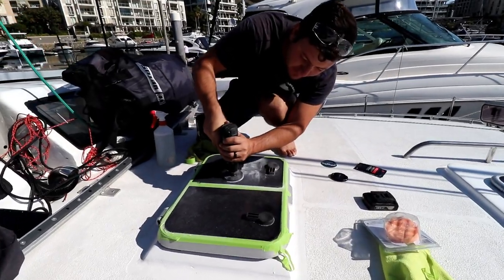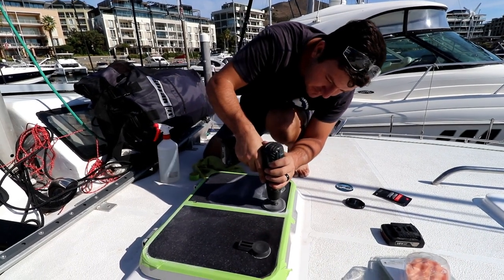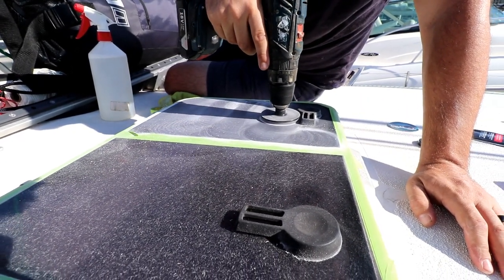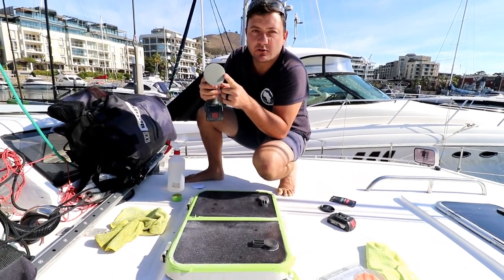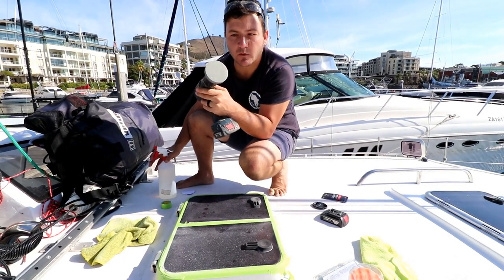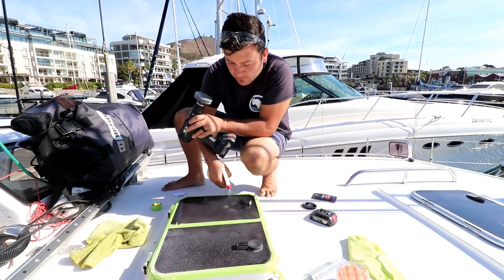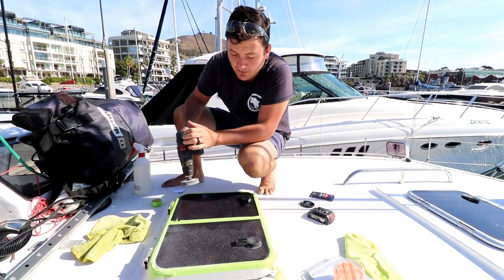We started seeing a bit of difference, but nothing drastic yet. The next step is the 3000 unitized pad, and we've got to keep this sucker wet. You have your spray bottle, spray the lens. Oh, I think I can already start seeing better through it.